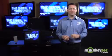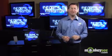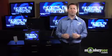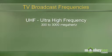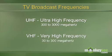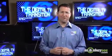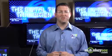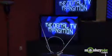Now the good news is, if you use an antenna today to receive free over-the-air television in the analog world, chances are you can use the same antenna to receive a signal in the digital world. In the digital world, most stations will be broadcasting on what's called the UHF frequencies, ultra-high frequency. Some will be broadcasting in VHF. If you have an antenna that's capable of receiving both UHF and VHF, you're all set. That antenna that works in the analog world to receive UHF and VHF stations will continue to work in the digital world.